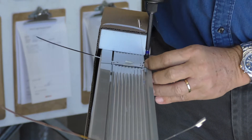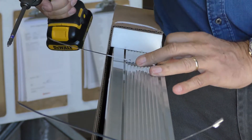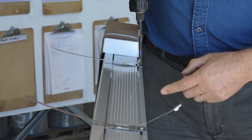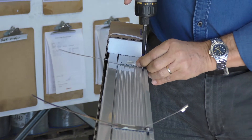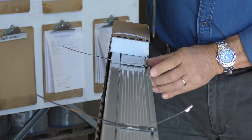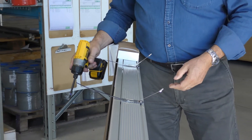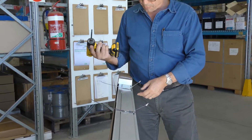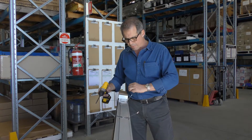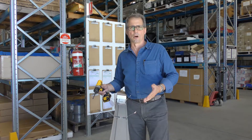It's really easier to do it on the ground. No pre-drilling required. You can even do it with just a hand screwdriver if you don't have an electric driver. Then that just flips over and you run your cold pipe all the way through. These speed clips are for the cold pipes only — you don't need them for the hot pipe.